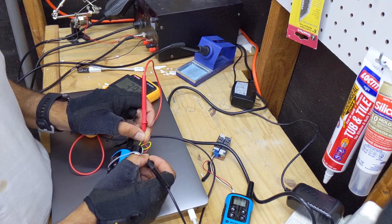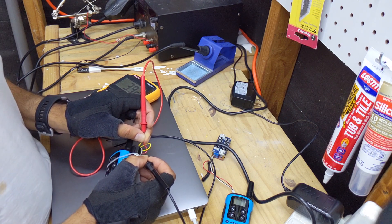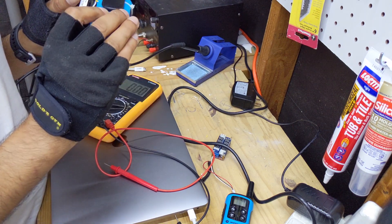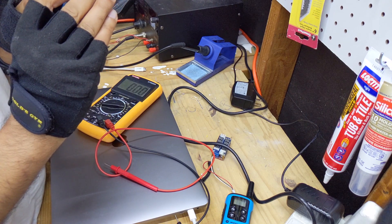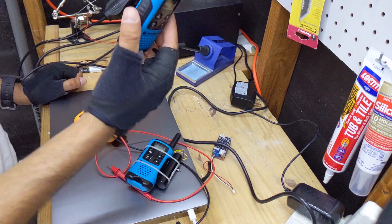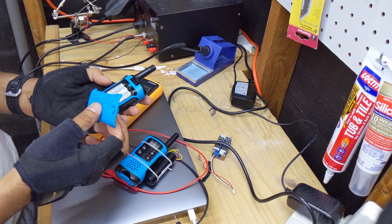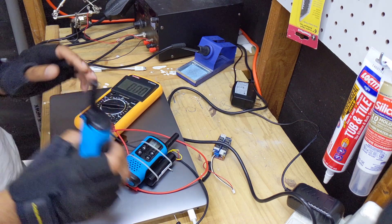The LG cell is reading 3.92 volts — it started at 4.1 volts fully charged and is still going. When I originally charged it the cell was at 3.3 volts. The charger now shows 3.62 volts as the lower threshold, so we still have more capacity left. The LG cell has already outlasted the fully-charged NiCad triple-A's. I'm expecting at least double, maybe two to three times the battery life compared to the triple-A's. Thanks for tuning in — if you have DIY project ideas, hit me up in the comments. Keep tinkering and stay safe!